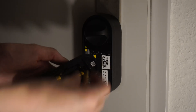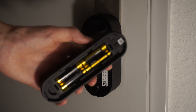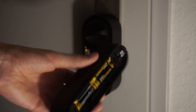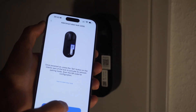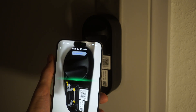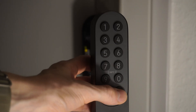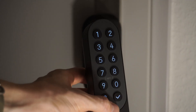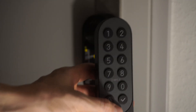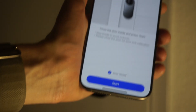We should fully load it up with the triple-A batteries included in the box and we're pretty much ready to go. From here you can use the Aqara app to start the pairing process — press the little set button, scan the QR code, and it will guide you through the next steps, including adding a user to the door lock, which will ask you to add your fingerprint and set a PIN code. From there, I did the calibration process.